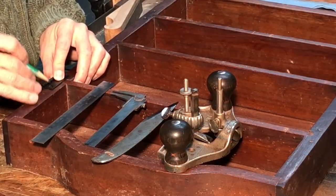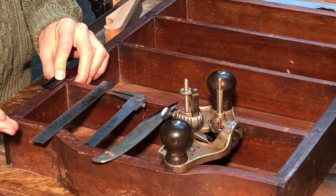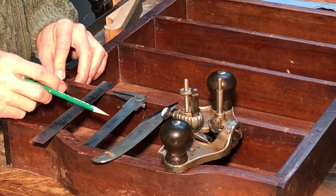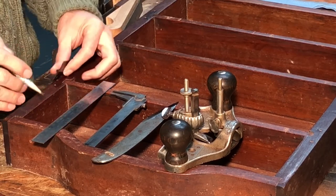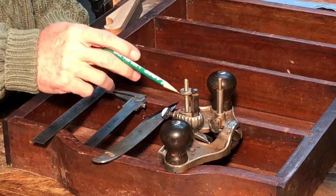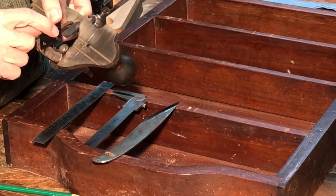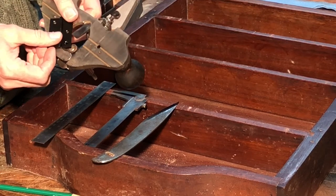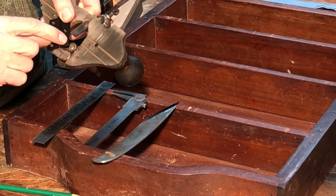In order to inlay this hinge into the right depth that I need, I'm going to use several tools. I'm going to use a Japanese marking knife, some calipers to check the width of this, and the rule again to cut straight, and a number 71 Stanley router plane. I set it to be flush with this piece here because I don't want that to go in any deeper than that. And so that's what my cut on the cabinet will be, is that little bit.